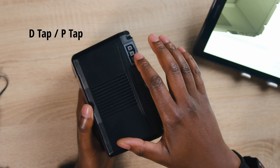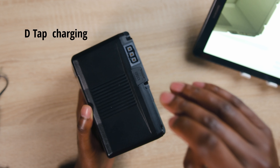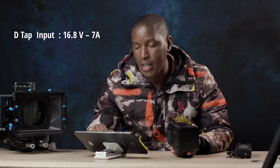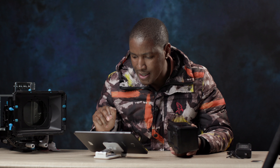If you look at this battery, we do get a few ports. The first one is your D-tap, and the D-tap is in fact both in and out — that means you can actually charge your battery from the D-tap or use it to power your equipment. Looking at the specification, the D-tap input is 16.8 volts, 7 amps max, so you can charge this at 7 amps maximum. I've also done some charging tests on this.